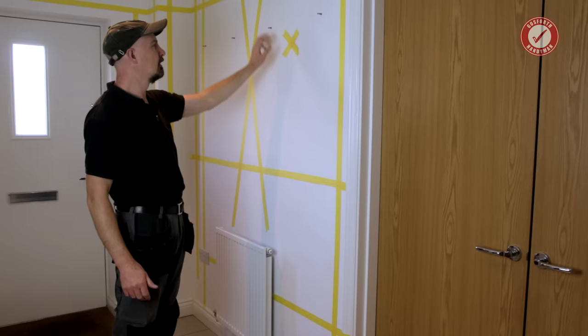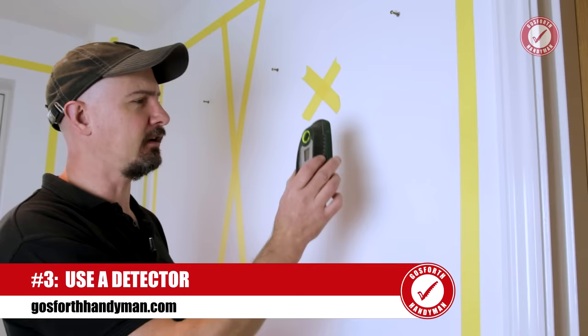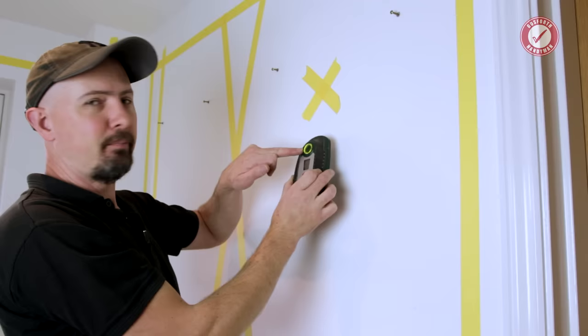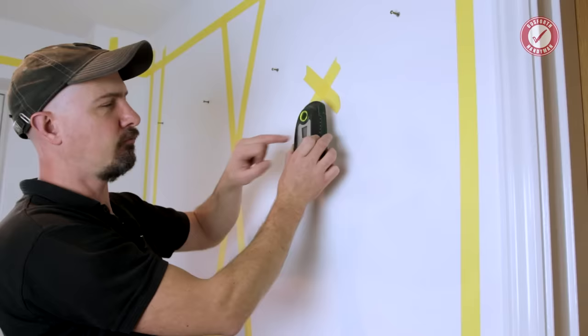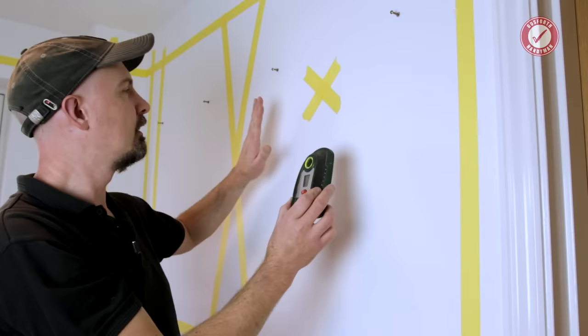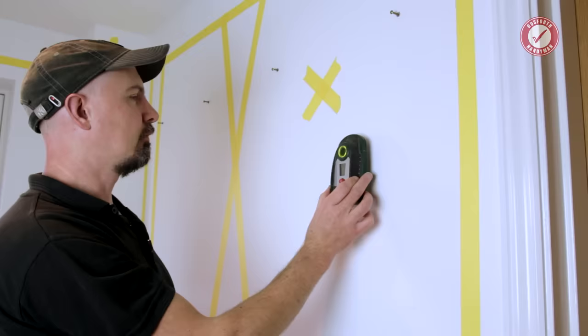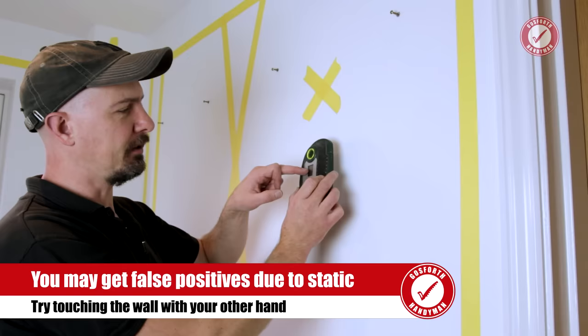Our spot where we want our hole is in a safe place. Tip three: always use a detector. This one has three indicators. I'm mainly looking at the display, which gives me a distance range for how far the metal is away. Checking around here, I've got a green light, it's not beeping, and nothing on the display. Sometimes walls are filled with Celotex insulation — Celotex is covered in foil and the detector can pick up the entire wall. If your detector is constantly beeping at about the same level across the whole wall, it's probably just foil insulation.